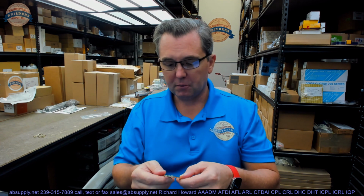So I would most certainly suggest that if you're putting in Schlage locks, think about what keyway you need or would like or would be best served by. You're not going to get Everest in every single lock, I don't believe, but you can certainly get it in all their commercial locks, and it is a way to really know pretty securely that if you give this key to someone and they give it back to you, that they've probably not duplicated it. That's not the case with the C or E keyway. While it's not protected and you don't know that absolutely, I can't tell you anyone in town that you can walk in and just get one of these cut. I would be surprised if locksmiths even cut them in smaller areas.